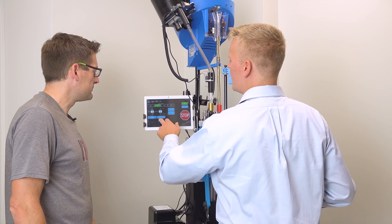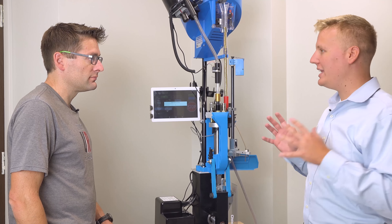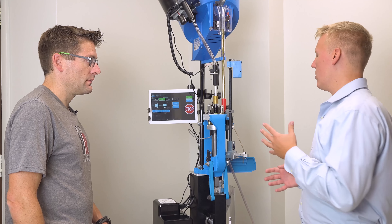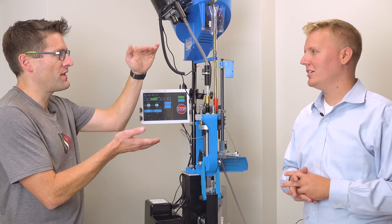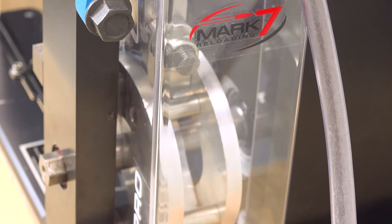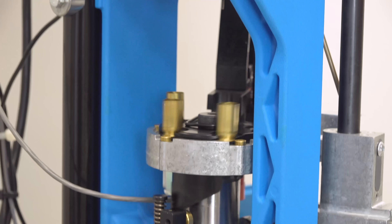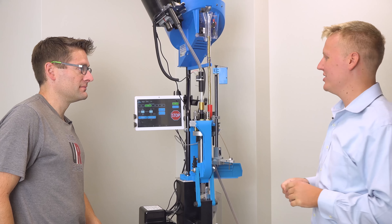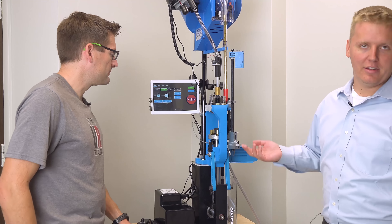Just a quick example — I have my digital clutch set at four, and that's usually where I run it when I'm doing 45 ACP, four or five on the 650. It's programmable from zero to 20, so I'm running at about 25% capacity of the motor. I'm going to do a single cycle at one. Digital clutch activated — that tells me I need to set my clutch higher, but this is how you know you're not going to get into trouble and break things. Peak force should be here and then deactivated if it's here. You want the digital clutch to be as low a value as you can, because it's a little bit safer. These motors are extremely powerful, and if you ran them at full tilt all the time, you start breaking components, you start hurting your dies — especially when you're running a carbide die set with a couple hundred dollars invested in nice dies. You don't want to send brass the wrong way through them. So I'll arrange my digital clutch back up to five, and it cycled and knew it was okay to go.